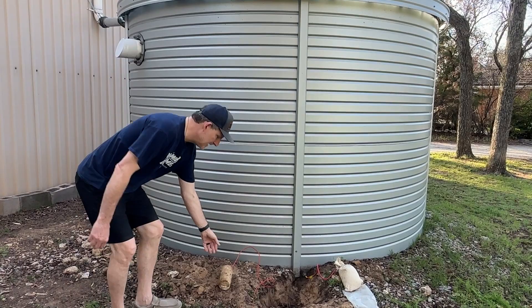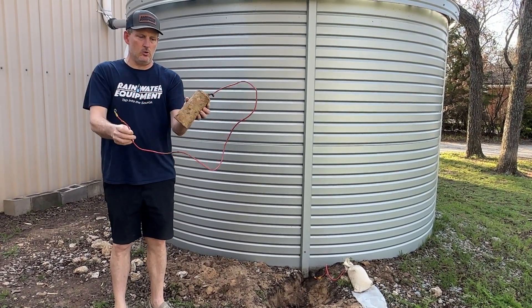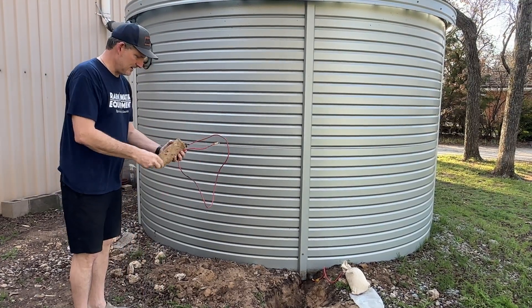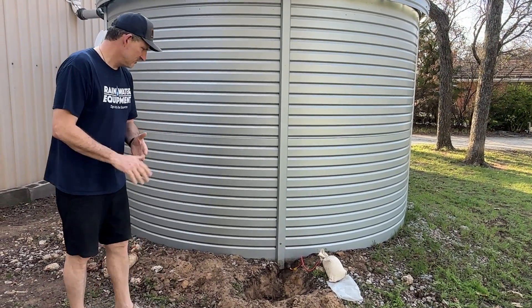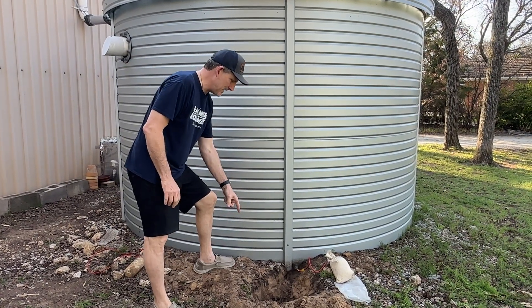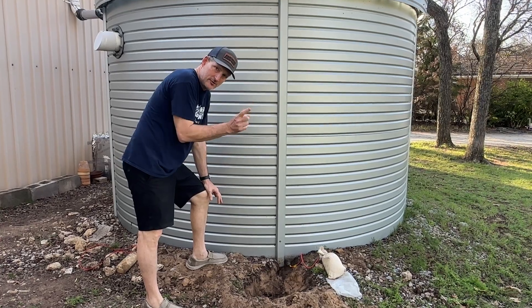In this case, I have recently dug up the old magnesium anodes and here's the cable that it came with. I'm going to now replace it with a fresh bag of these. Whenever you do this, they're generally buried about 18 to 20 inches or so down in your sand pad, on either side of the tank.